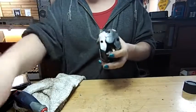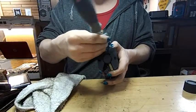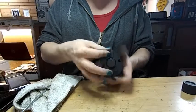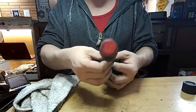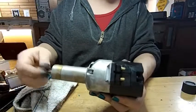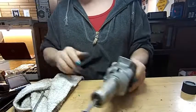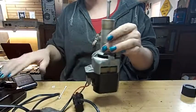We have our brushes in place. We need to lock them in with the little covers. I think when Singer was making this motor, they literally designed it to be serviced — easy to replace the brushes, easy to clean the commutators. I even think they were designed so you could replace the windings, which is unusual. I've got it jerry-rigged up to my test harness — stay away from the bare wires — and let's see what our motor sounds like now.